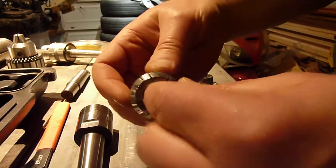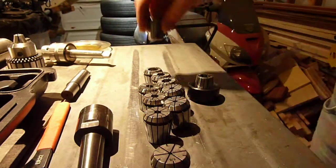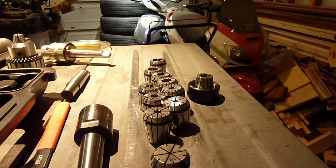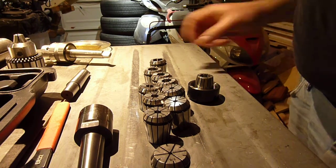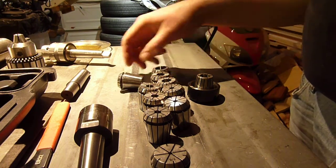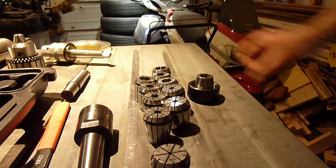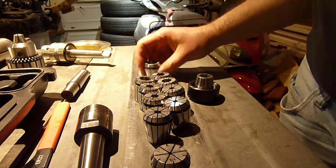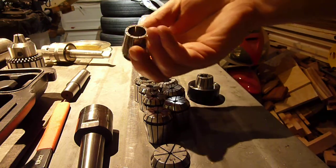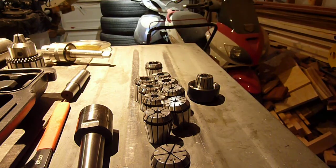That range is going to handle most of the sizes of mills I might possibly work with, or I could put some round stock in there too. These collets were oily as can be — covered with whatever oil they used over there — so I used brake cleaner to wash them all off. A little bit of metal came out of them too, little metal filings that were on the table after I washed them out. They're all nice and clean and relatively oil free now. They look fairly decent, considering I paid about $45 for this set of collets.